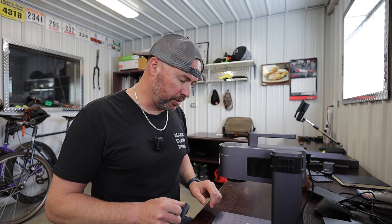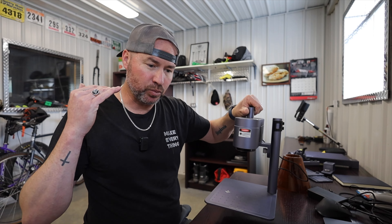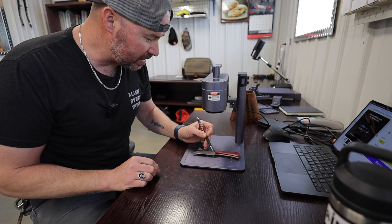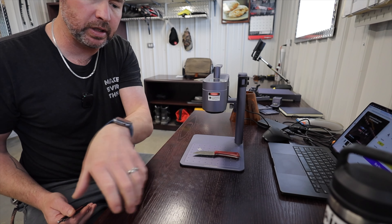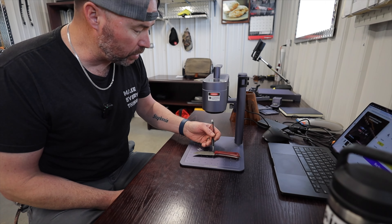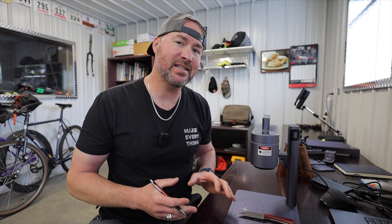For a lot of marking on stainless steel knives, I actually kind of prefer the 2-watt infrared. The other nice thing with this style of laser is the workpiece sits here and the laser head stays up top. That's really handy for something like a knife — I can set the knife right here and put my logo in as tight as I want. With gantry-style lasers where the head moves around, I have a couple of knives where the laser ends up hitting the handle — no good.